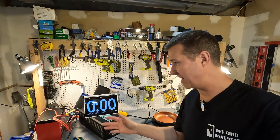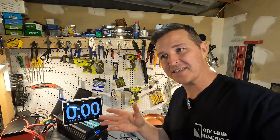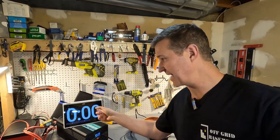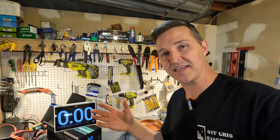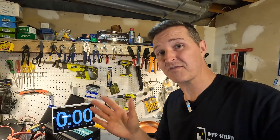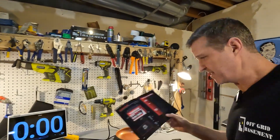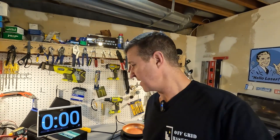The Cyclin Bat battery is connected to a 5000 watt pure sine wave inverter from NX Moonfree. We're going to run 100 amps continuous for about five minutes to make sure everything is fine, then bump it up to about 160 amps — because after 130 amps the BMS should cut off after 10 seconds. We also want to test the 330 amp peak for 5 seconds, and check how accurate the app is during all of this.